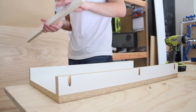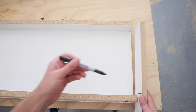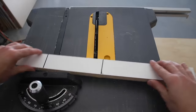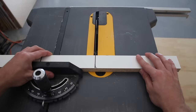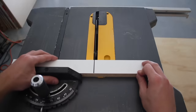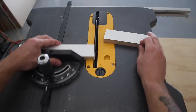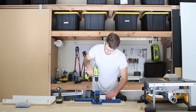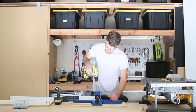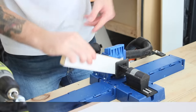After installing my two side walls, I could mark and cut my end pieces to length on the table saw. If you don't have a table saw, don't worry — you could use a circular saw, a miter saw, or even a jigsaw. A table saw is just convenient for sneaking up on the line to get a really tight fit. I chose to use pocket screws to attach my side walls to the rest of the melamine form — quick and easy, but totally not necessary.